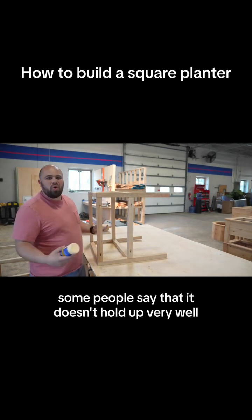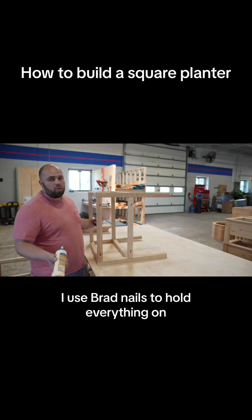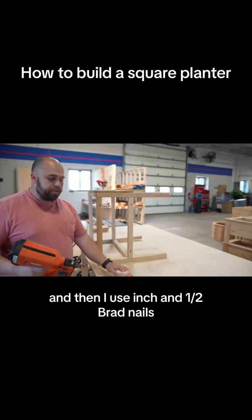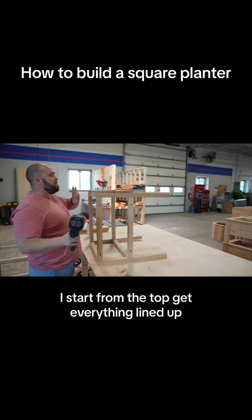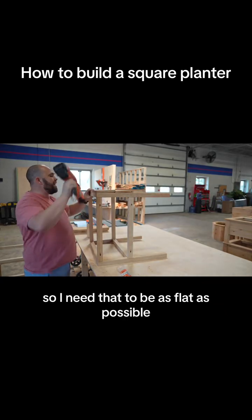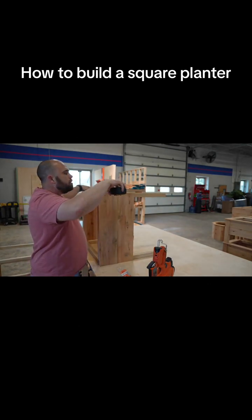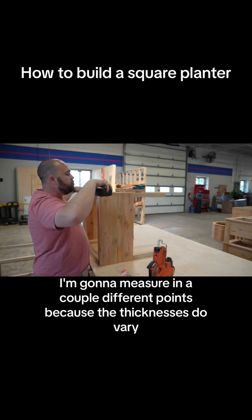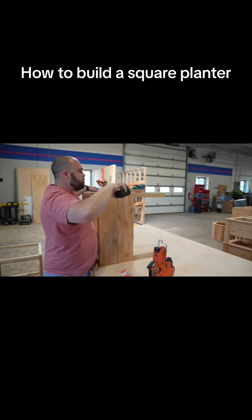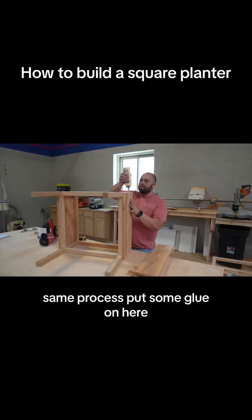I use glue when putting the cedar on. Some people say it doesn't hold up well because cedar is very flaky, but I disagree — it's personal preference. I use brad nails to hold everything on; I feel like without the glue it won't stand up as well. You could use screws too, but I don't like that appearance. I use inch-and-a-half brad nails. I start from the top to get everything lined up since I'll have a railing up there and need it as flat as possible. Now that I have two sides on, I'm going to take another measurement — I'll measure at a couple different points since thicknesses vary — and go from the widest point. It looks like 24 and a quarter is what I'll go off of, so I'll cut those boards and repeat the same process.